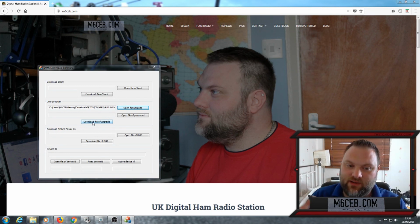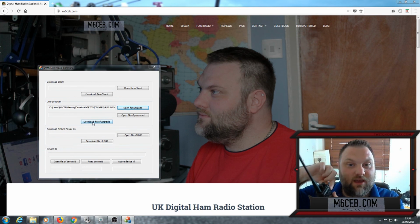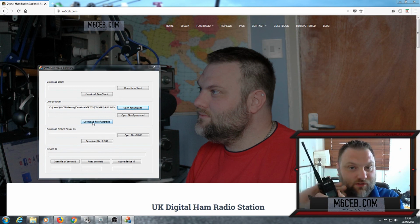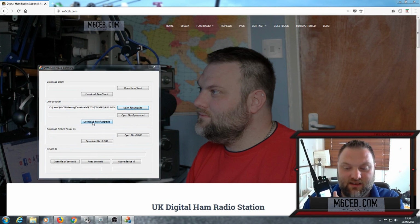Once you've got that pop-up saying success, turn your radio off. Take your programming cable out of the radio so there's nothing connected to the radio, and then turn your radio back on, and then you've upgraded the firmware. So that's basically it. Hope that helped anyway.